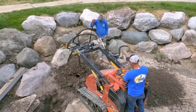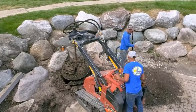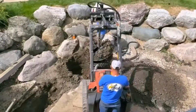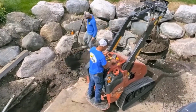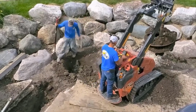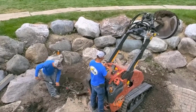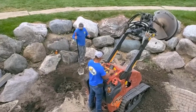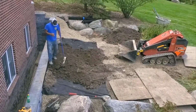I always tell you guys, remove a lot of the heavy soil, remove a lot of the clay, and replace it with stone. And you've seen in that footage with all that water that the high octane moved it. The high octane has the biggest inlets. The 8-slot yellow, you guys think, oh, this is just a color. Oh, it's blue instead of yellow. No, the high octane has 17.25 square inches of inlet per linear foot. And you've seen the kind of water it moved in that video.